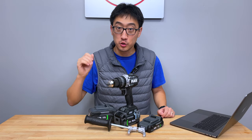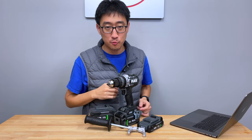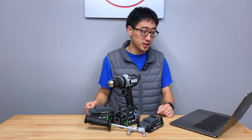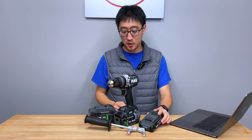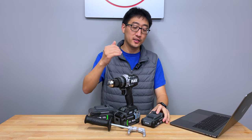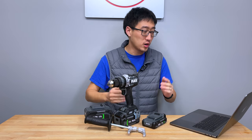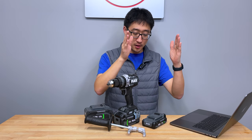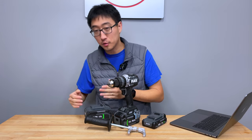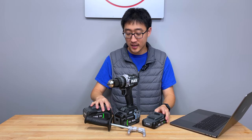All right, hope y'all caught those numbers because those numbers went by really fast. Just in case you didn't, we're gonna do a recap. But before we do a recap, I'm gonna tell you how we run all the tests, and this is pretty much the same for every test that we do in this drill series, right? The way that we run the test is we run a series of tests with all the battery packs, and we let the tool rest a minimum of 30 minutes between each battery pack set, right? And then when we run with the battery packs, we run three on the 5/16 inch lag, then three on the half inch lag, then two on the auger, and then I think three on the masonry, right? So most of the tests are done that way.